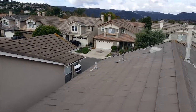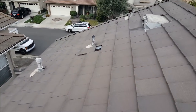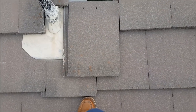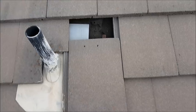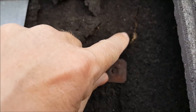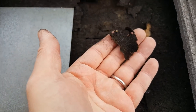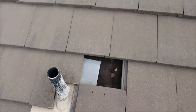Over here, no slip tile — but keep investigating. Remember, don't let roofers just kick tiles back up into place. I see a little slip tile — they'll just kick it right back in place and say 'that's fixed.' But if you look closely at the underlayment, it's actually damaged all the way through. You can see the decking — that's a leak. Just right here the underlayment is totally bad. The whole roof doesn't look like that, but this area does need to be fixed. Check each one.